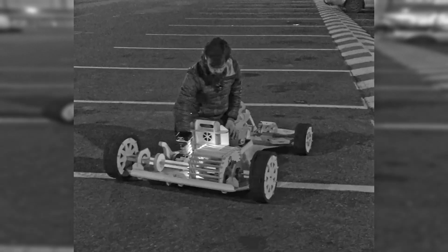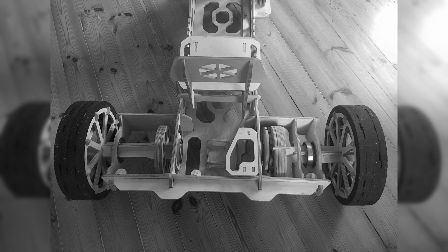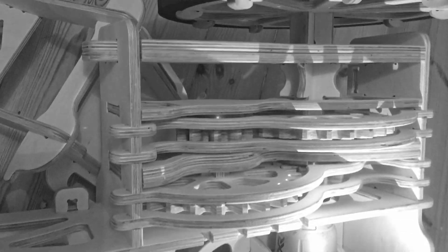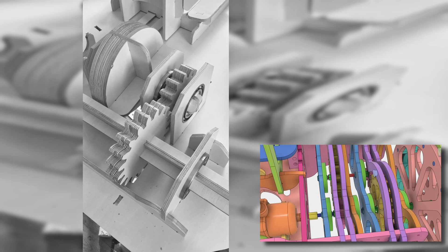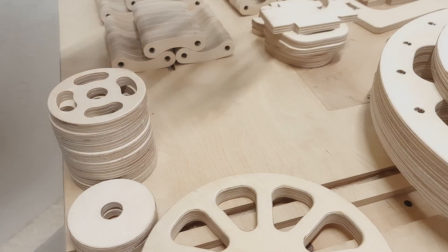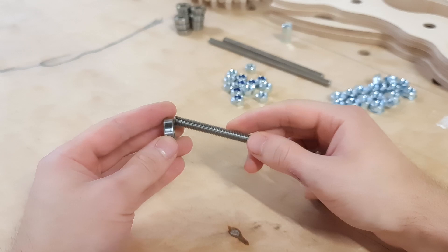The hardest section of the project was coming up with a good way to transfer the power from the cordless drill to the back wheels. For the first prototype, we attached the drill to a gear assembly that would transfer the rotation directly to the wheel axis, but it turned out the drill couldn't move the cart. So we had to use multiple gears to reduce the input power needed, which of course also reduced the speed. After testing out different gear ratios and assembly solutions, the go-kart could drive. The only problem was getting the components to stay in place while driving. In the previous design, we made the gear axis out of plywood, which wasn't as simple to secure in place. To fix that, I wanted to try replacing the axis with a threaded rod and using different types of nuts to secure the bearings and the gears in place.